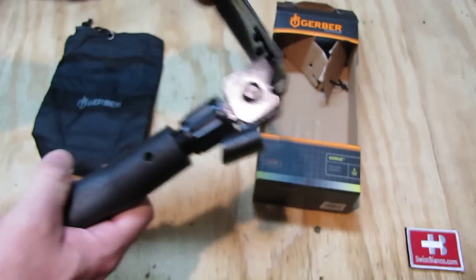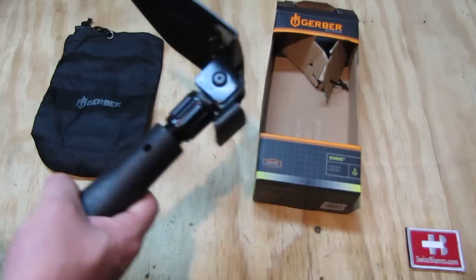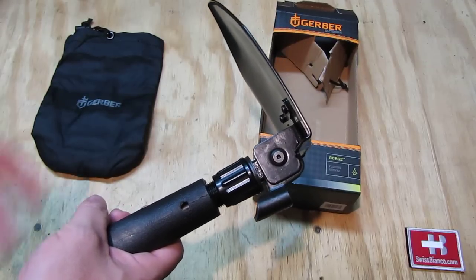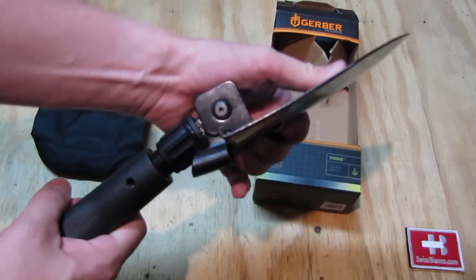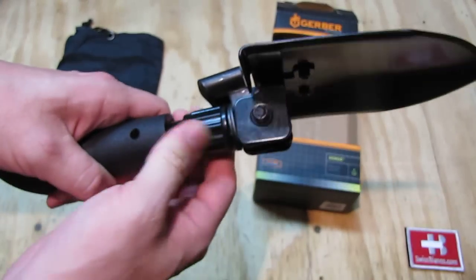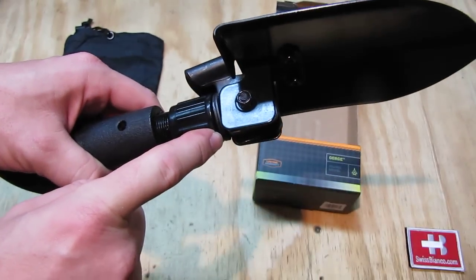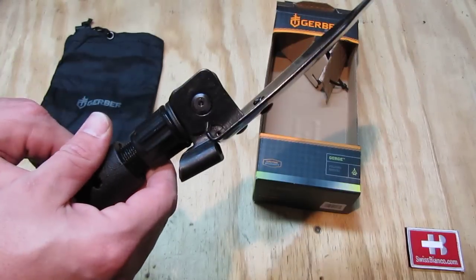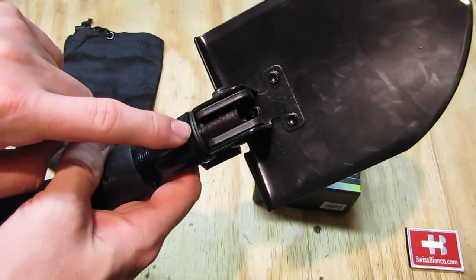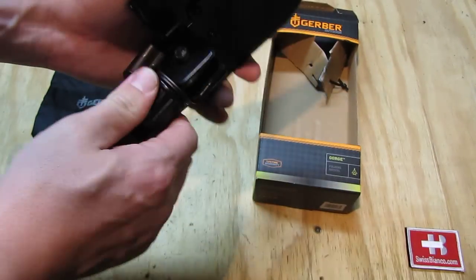With the knob in position, you can use the shovel like a hatchet or in the standard digging configuration. The knob itself is aluminum with two washers in front — that's usually the weak point, as the washers are not thick enough. The good thing is it's a screw, not riveted, so you can disassemble and replace the washers with thicker, better-material ones.